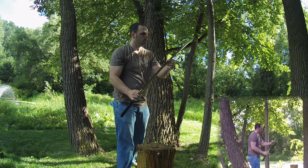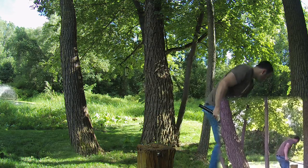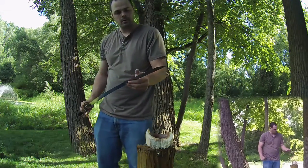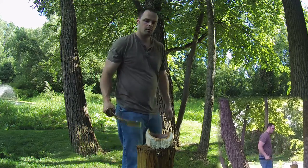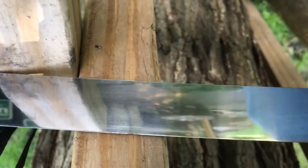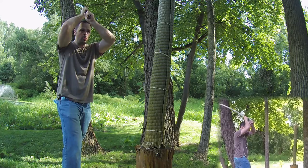The second time I did a strike, and it was not the best strike, I was off on my angle a little bit, and it dinged the blade slightly. Now it has a kind of, I wouldn't even call it an edge roll as much as the edge deformed and moved off to one side slightly in a very small area, about 2 millimeters long and about 1 millimeter deep, roughly. Now, that said, it's not really that bad in terms of damage. It's pretty minor considering a bad strike to a coconut, but it was notable that this damage did happen during the course of testing.